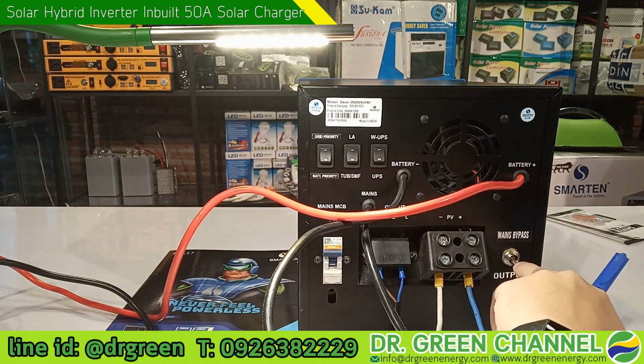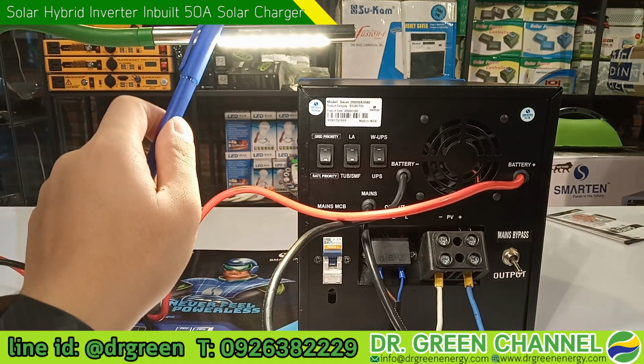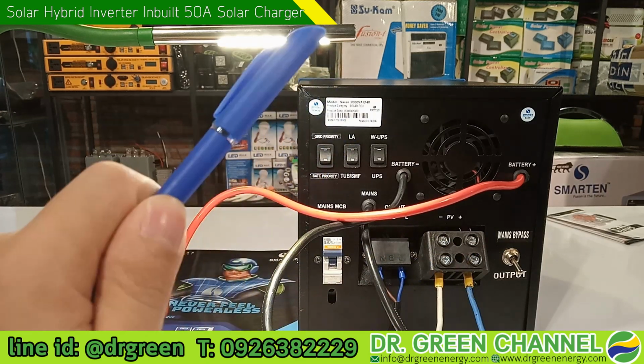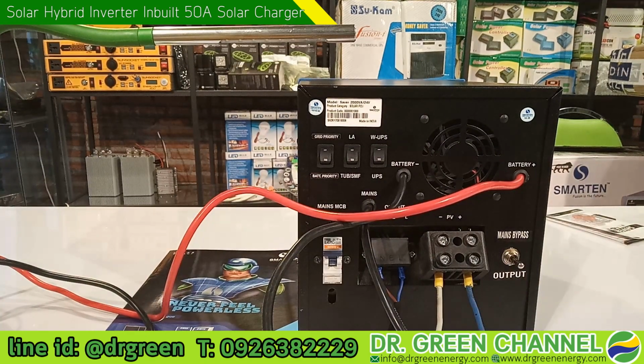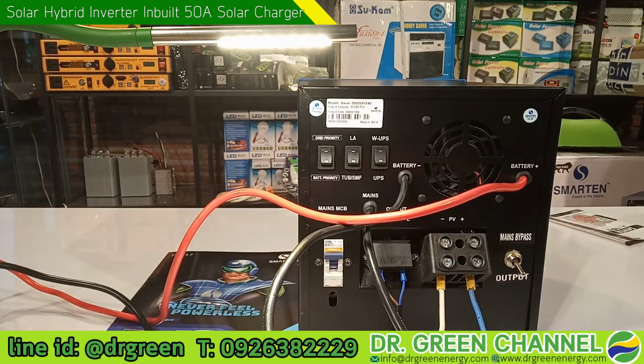But if we choose the output position like this, that means these loads will take care by this inverter or the hybrid solar inverter, or take care by this UPS. Okay, if you want to off this system, you switch it in the middle position. So there are 3 steps here. So for the normal usage, make it like this. All right. Okay, let's see in front again for the wrap up and overall status of this.